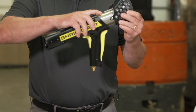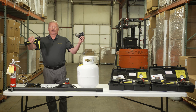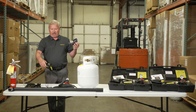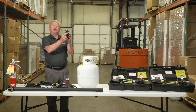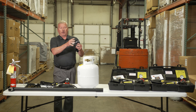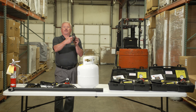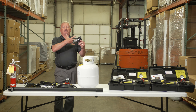We have a cool-to-the-touch combustor that we'll talk about when we actually fire it off. The combustor comes off very easily and allows us to attach two-foot, four-foot, or six-foot extensions — simply by pushing down the safety button and pulling off the combustor head. In addition to the combustor being cool-to-the-touch even during operation, inside the combustor is a flame arrestor screen. When you fire the gun and release the trigger, you cut off the propane flow — but the propane wants to follow the source of the flame back down the gun, which could be dangerous. The flame arrestor prevents this: when you release the trigger, the flame hits that wire mesh screen and dissipates.